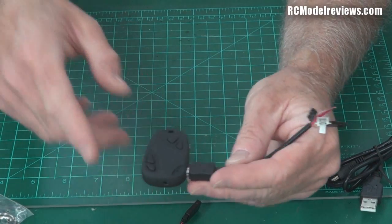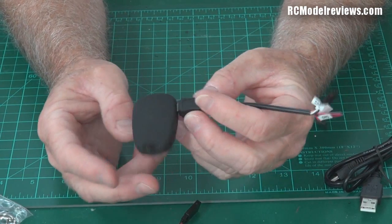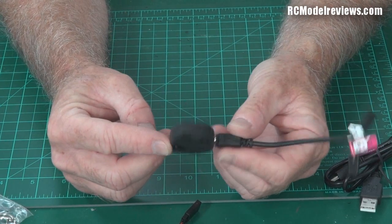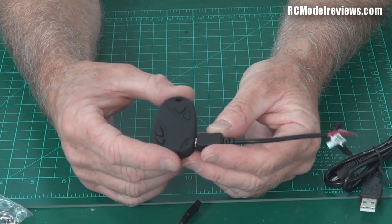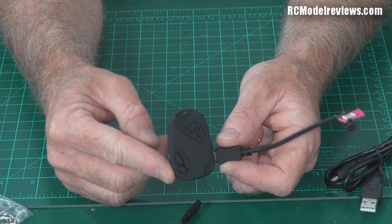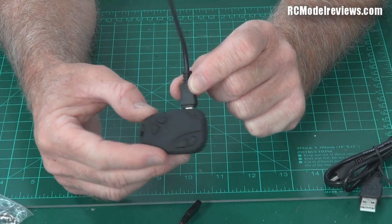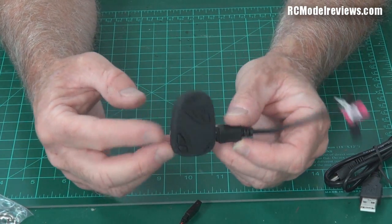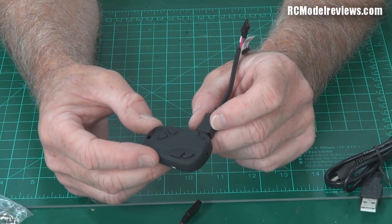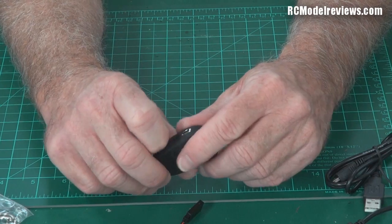What I'm going to do now is pull this one apart and see what's inside. I'm happy to do so because I've had bad luck with these - I got two at the same time from the same supplier. One worked fine for about a month then developed pausing and jittering. I tried a whole range of SD cards, reformatting them in the camera - class 4, class 6, class 10 - none worked. It's actually got a fault where the video locks up every few seconds. The second one had an absolutely dead-flat battery, so I transplanted the battery from the good one and ended up with one working unit out of the two.